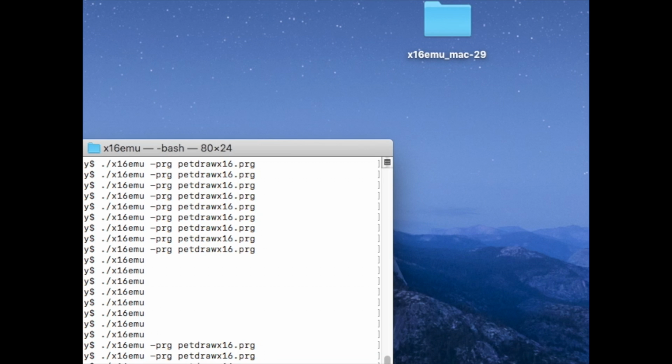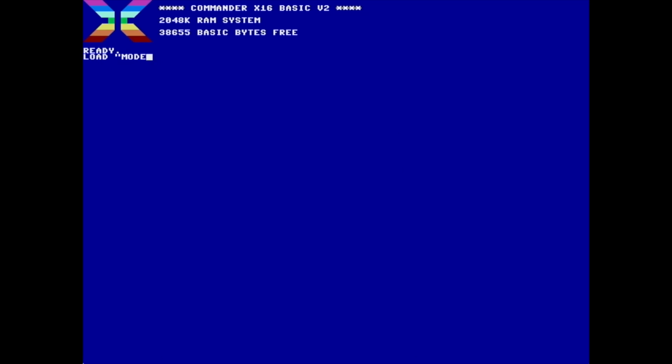Alright, moving along, I want to show you the Mode 7 demo. Now, I'm going to warn you, this demo only half works. This is a demonstration of the 256 color bitmap mode of the Vera chip. Now you may be wondering, why does it only show half the screen? Well, that's because it has to load the picture into low RAM and then copy it up to the video chip, and there just isn't enough low RAM to copy the whole picture in 256 color mode, so he's only loading half the photo. Obviously, what you would need to load a whole still photo into video RAM is a custom loader that loads a separate file from disk and then copies it directly into video RAM, which we just don't have yet, but that'll be coming. But anyway, you can get an idea of what the 256 color mode will look like.